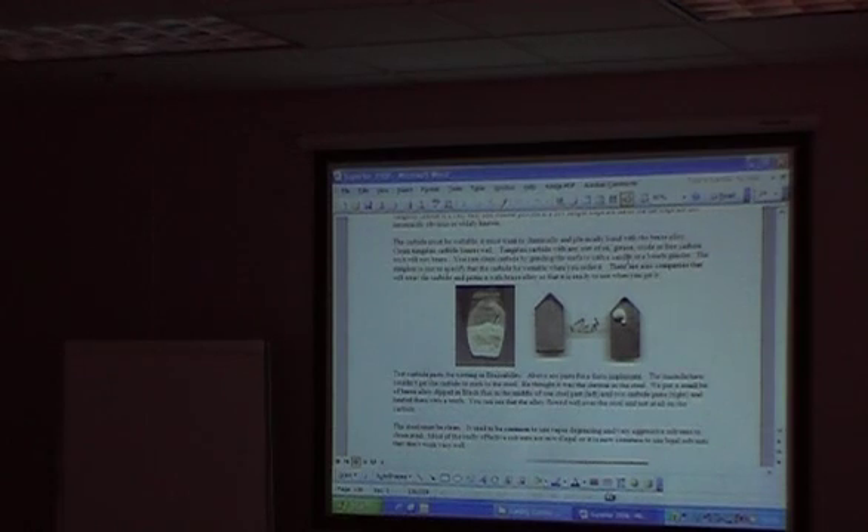Something else I told Emmett last night: the AWS specifications for braze alloy — a 56% silver braze alloy will be 55 to 57%. The specs we get from you guys are 56 and a fraction measured in the millionths, so your 56% braze alloy truly is 56%. The competition can still be within the American Welding Society specs and sell a 55.1% braze alloy. This is really important to us because we have computerized belt furnaces — we control the speed within a tenth of a second, the temperature plus or minus two degrees. So if the alloy composition is not exactly right, they don't flow right.